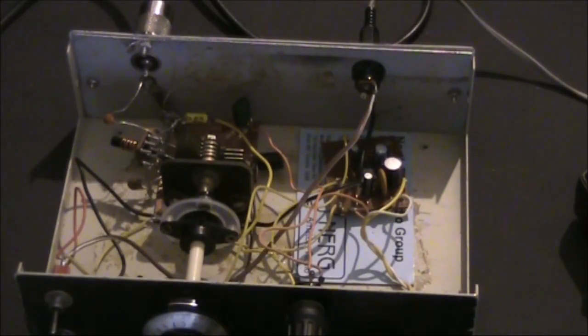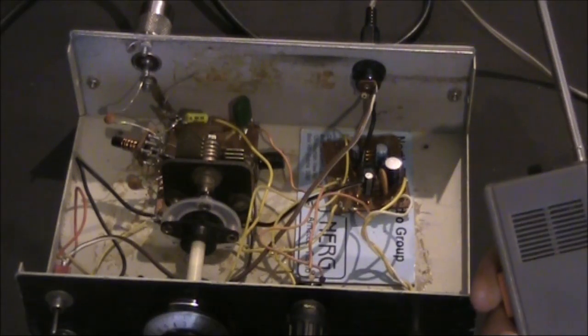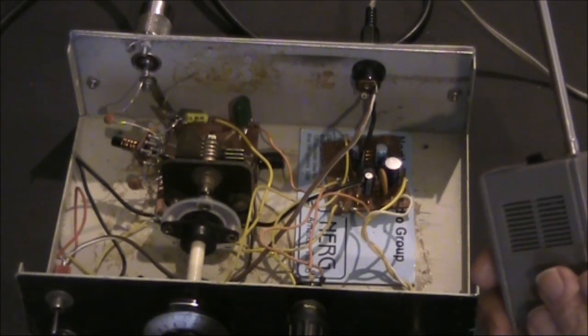I'm not sure why you'd actually build something like this in 2021, because VHF low band is pretty much deserted. 27MHz CB has pretty much gone apart from occasional activity. 28MHz is generally a fairly quiet band for amateurs except in the middle of summer or during a contest. Commercial services have pretty much departed everything below 100MHz, and that goes for TV as well — no TV stations in Australia below about 170MHz. So it's pretty much just a novelty these days; you'd build it just to get the idea of building a receiver and might not expect to hear very much on it.